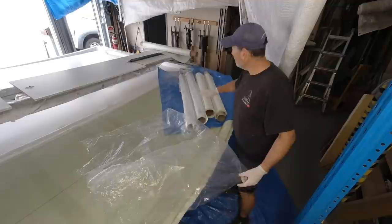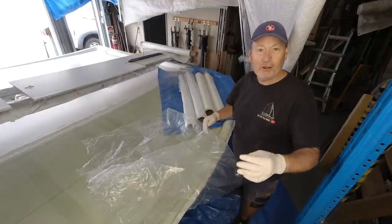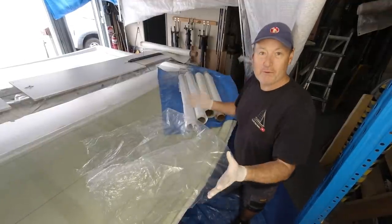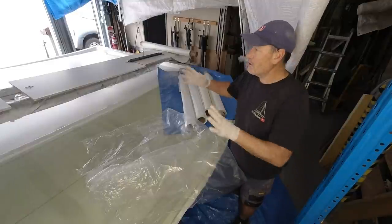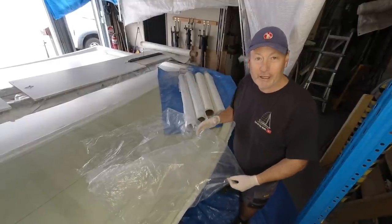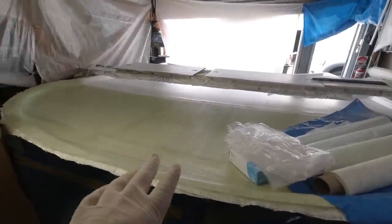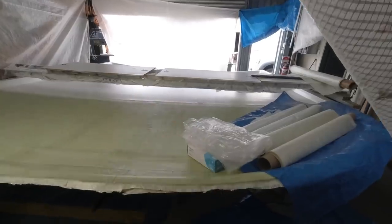So I cover all of my substrates up before I start spraying, because it is airborne. Even my camera gets a mist on it, so that's really why I've tarped up and why I'm really quite paranoid about the overspray, particularly around the area here. I don't want any overspray. So now it's going to have foam, probably on this area around about 10 mil foam, and then I'll be going to a blend of different thicknesses at the back there.